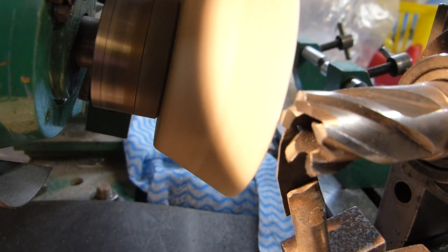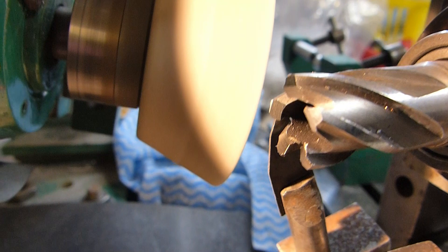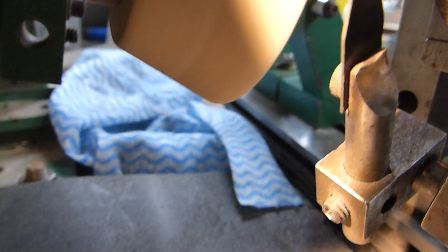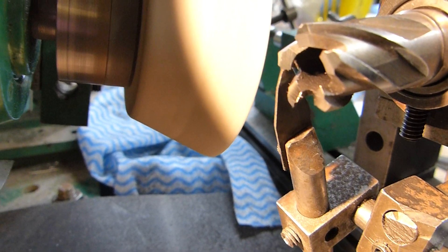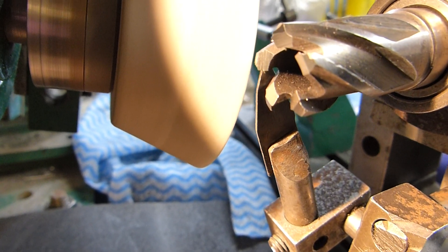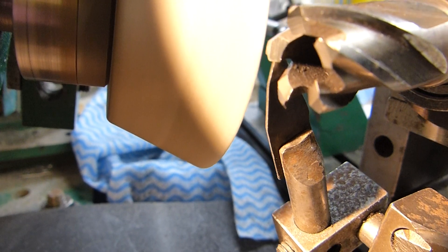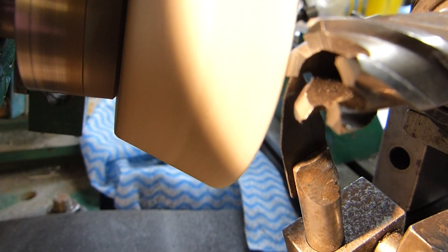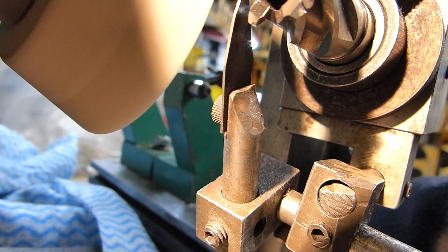Here's another view of grinding the first 15-degree angle. The wheel head on this machine is tilted. The clearance angle I put at 7 to 8 degrees, which is enough — you don't want any more because it just weakens the cutting edge. You do need to be careful setting the wheel so there's enough clearance so it doesn't catch the tooth above. You must make sure that the wheel clears in the gullet, so you do need to set a stop on your machine so it won't go any further forward and catch the tooth above.